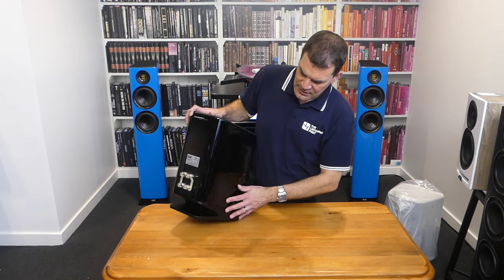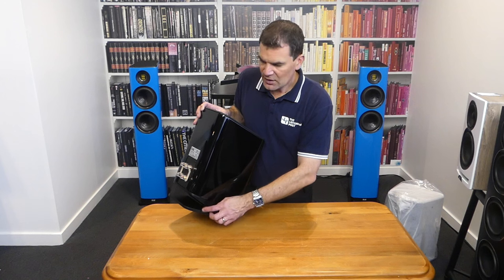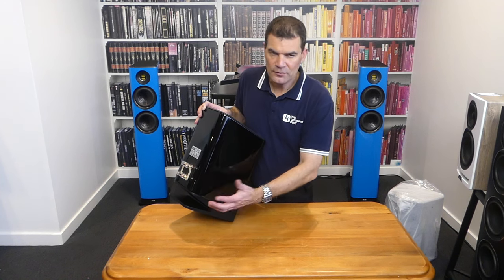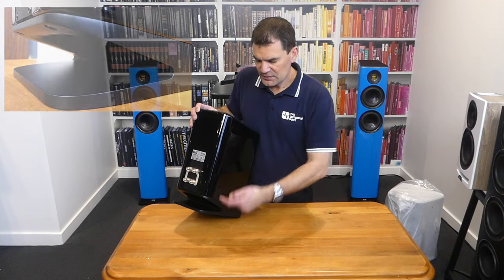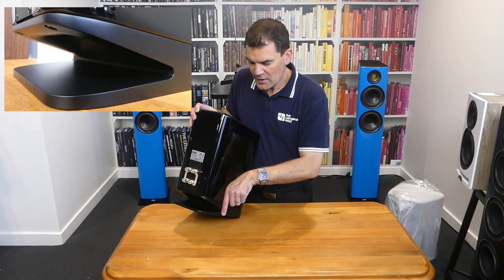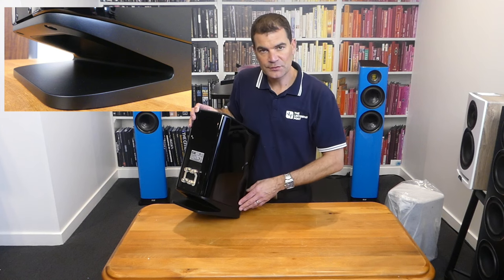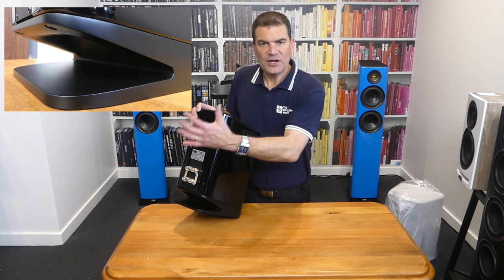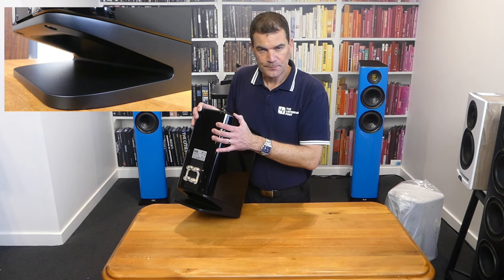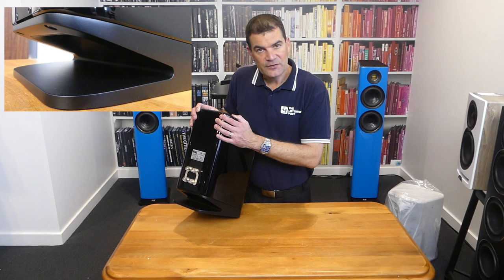It's at the side that we pause though, and we see this sort of high-heeled shoe kind of design, for want of a better word. The port is in the base of the speaker, firing into this metal plate. This helps to disperse the air pressure evenly without the chuffing involved with a traditional port. Again, hideously expensive to try and do well, but ELAC has mastered it.